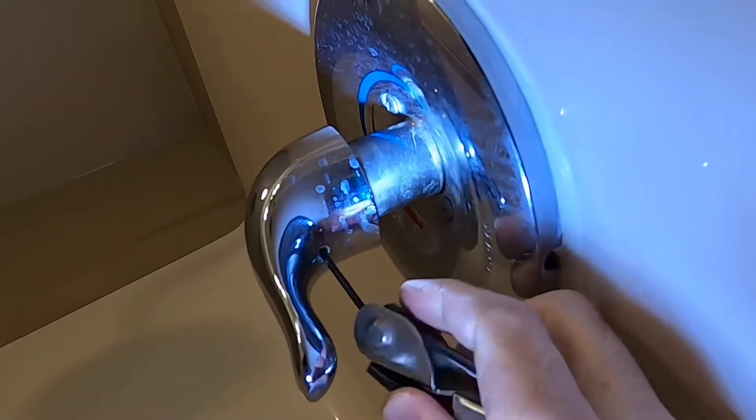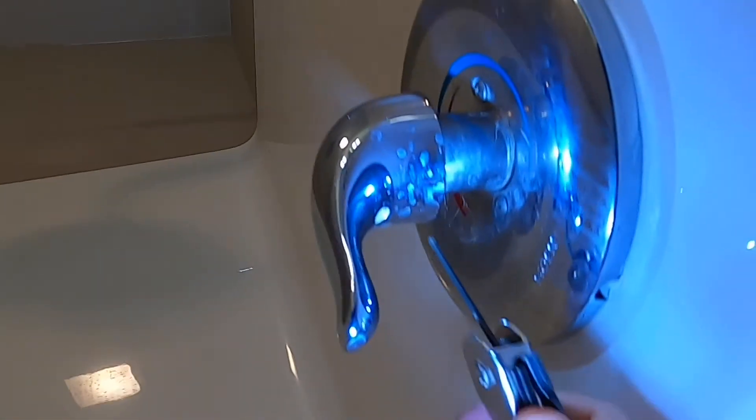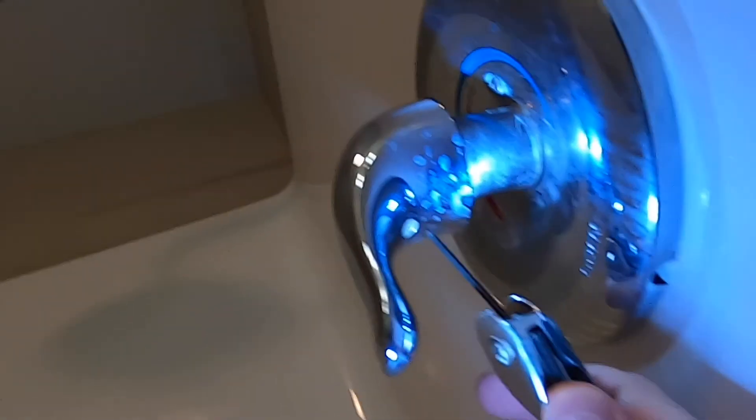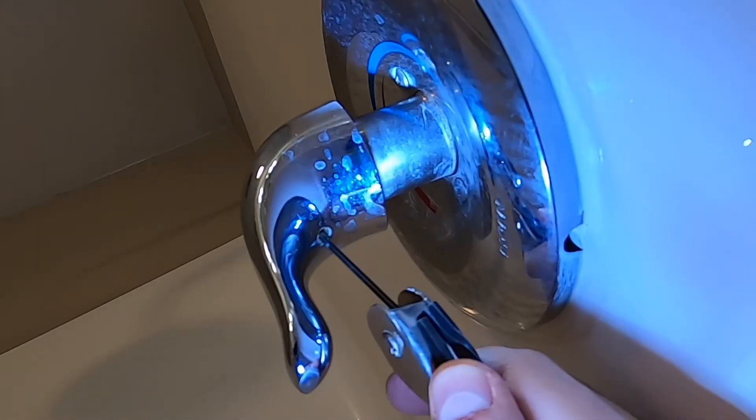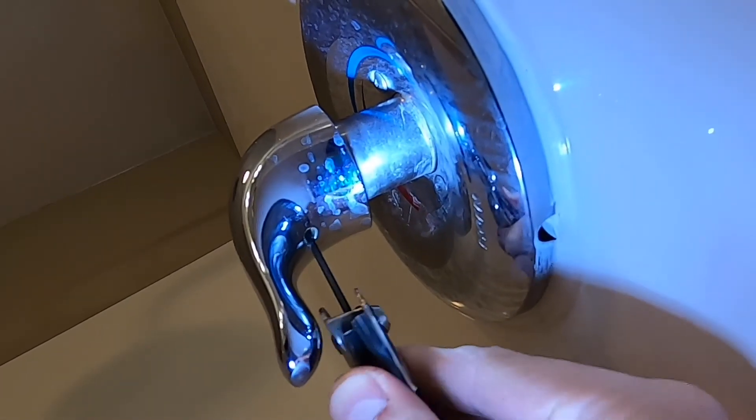Here's how it works: you're going to take the handle off. In theory it's pretty simple — we've got an allen wrench and a hex screw that sets the handle in there. You can see there's an underside shot there. Again, in theory it's pretty simple, it should just unscrew. However, if it's been in there a couple of years it might be jammed up, so you might want to spray it with some lubricant.